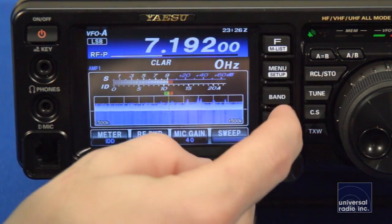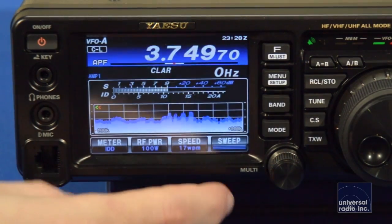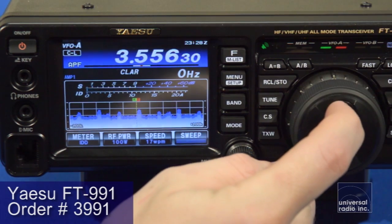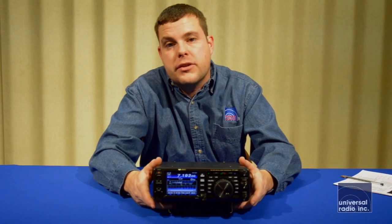The scope on this has two modes at the bottom of the screen: a small waterfall display or a standard scope screen showing band activity. The sweep button on the touchscreen will refresh the scope image, but note that it does mute the audio — it only has one receiver, so it can either run the scope live or pass audio, not both. There's also an automatic scope function where, as you start tuning faster on the dial, the scope mutes the audio and you can tune to where you see signals, which works very fluidly on both HF and VHF/UHF. Please check back on our website at www.universal-radio.com for the most current information.